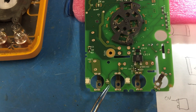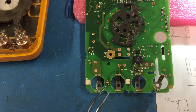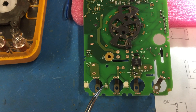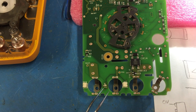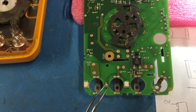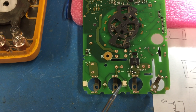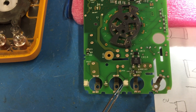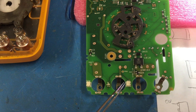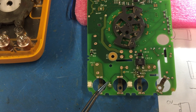For further interest, if you put a scope on here you find there's a pulse of about 200 microseconds. With it in operation you can't actually see the infrared with a digital camera because the duty cycle is very short. The photo receivers — the photo transistors — have some buffering circuitry; here's one of the buffers up here and the other buffer is on the other side.